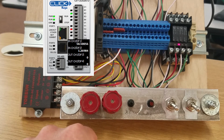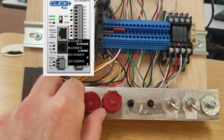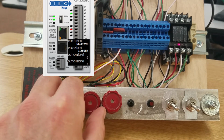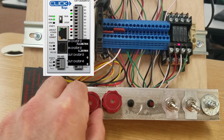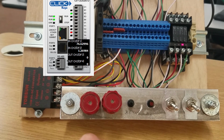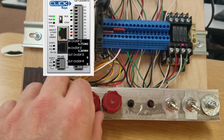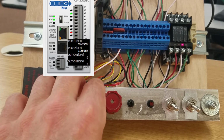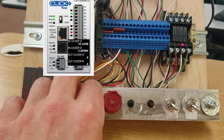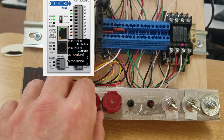At that point, we should switch over to solenoid B, which is going to keep filling the mixer up until we hit the 75% value. At 75%, the mixer motor should turn on and start mixing. Now this would agitate the liquid in the mixer, so if we turn the level up or down, it does not turn the mixer off. The mixer stays on, so we should see no impact at this point. The mixer is going to mix for 30 seconds.